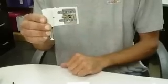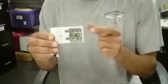Now if you got 2 or 3 hinges on it, it depends. If you want to just take the whole sash over, you got to adjust all adjusting screws at the same time. If you just want the top of the sash to go over, which will raise the bottom of the sash, you do the top screw and vice versa.